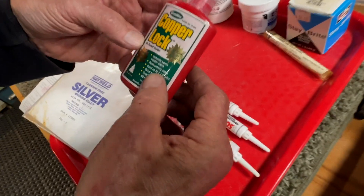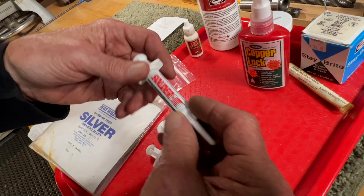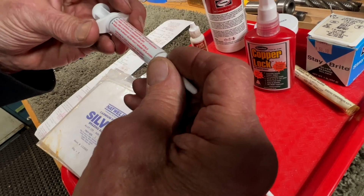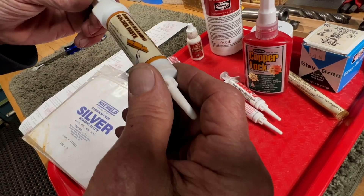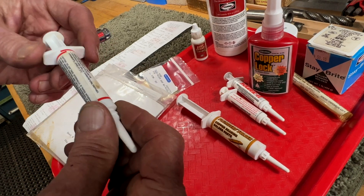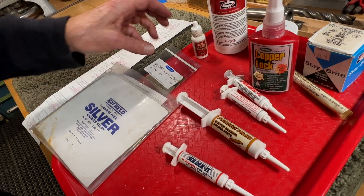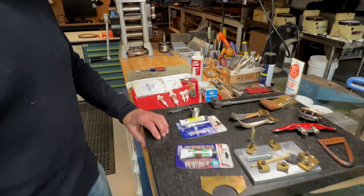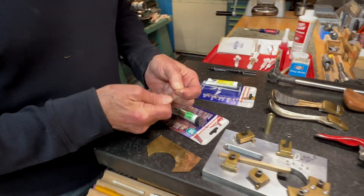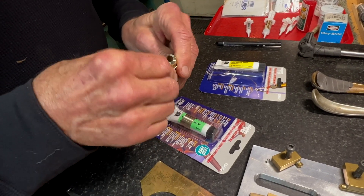You can also buy solder ground into a powder and mixed with paste. This one is copper for plumbing pipes, this is a silver bearing solder paste that doesn't specify how much silver is in it, and this one claims it works for aluminum and pot metal — you're welcome to try that, though I've never found it very satisfying. Having said all that, silver bearing solder is terrific and very useful around the shop for a variety of tasks.